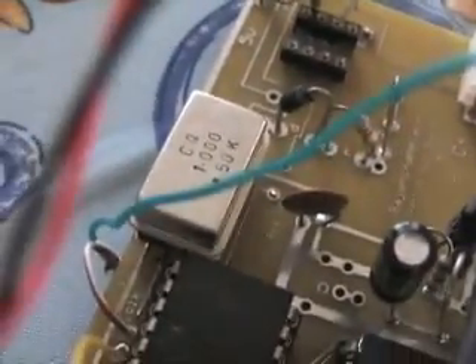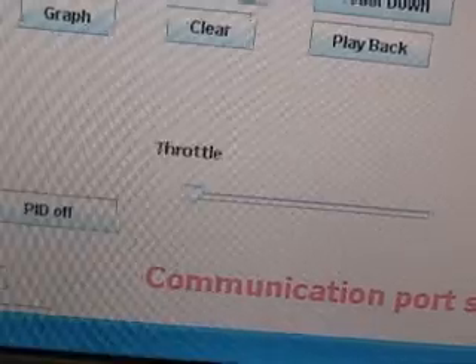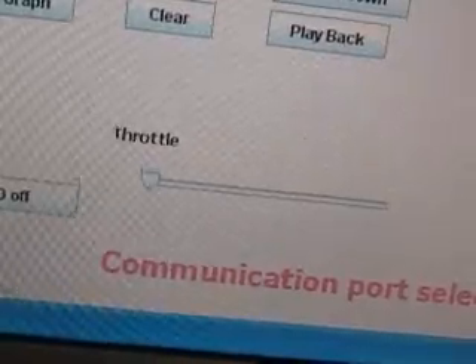The 877A microcontroller, along with the assistance of a 8254 programmable interval timer, driven by a 1 MHz clock. A Java GUI controls the actual servo. As you can see, there is a throttle that goes from left to right, and that controls the position of the servo. The communication is done via USB, using a serial to USB converter, right into the microcontroller.